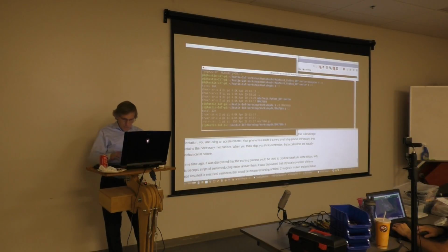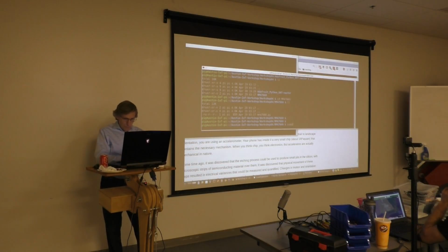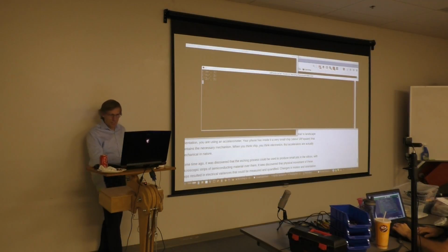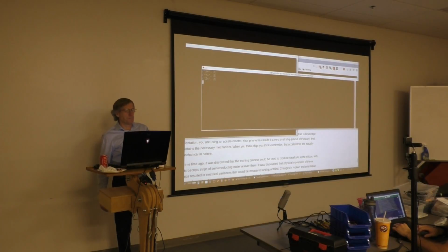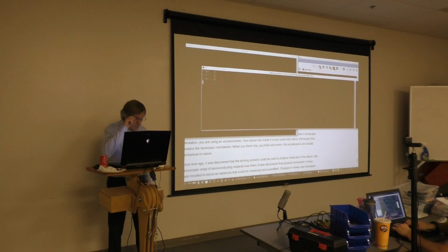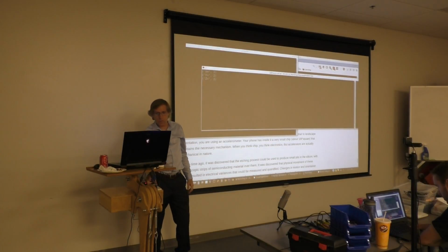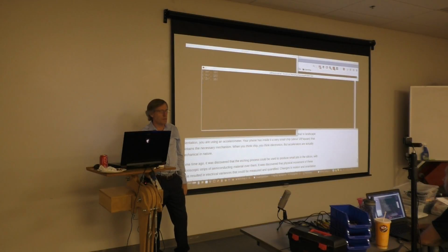So all that's left to do is make sure you use sudo here: sudo python MMA7660.py. And if all the planets are lined up correctly, there it is. Now, one thing you have to realize is this is not a loop. It's only set to run 1,000 times, so if you look back and it's gone, I freaked out the first couple of times. Is it in G's? I don't have enough information to actually decipher what these numbers mean. All I know is that when I take the accelerometer and put it up on an angle, the numbers change.